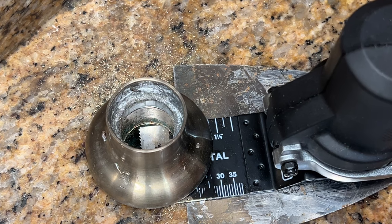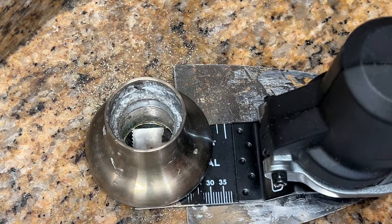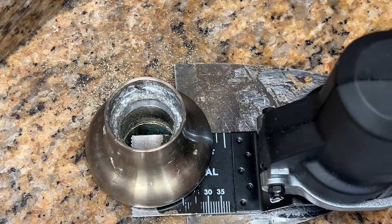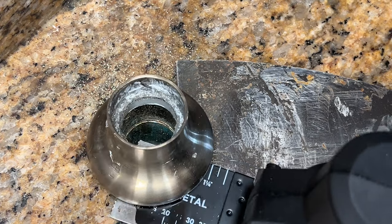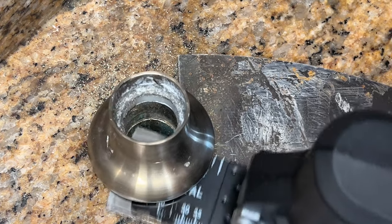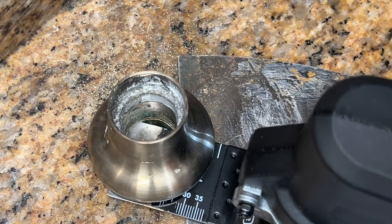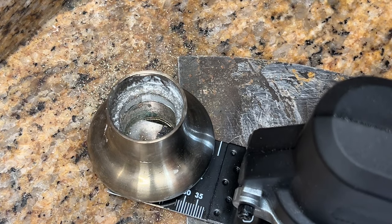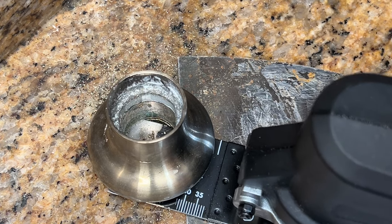When I knew I had cut through most of it, I got a little nervous about the forward pressure on the blade, so I kind of eased off a little bit and just let the blade do the work at the end, so that my oscillating tool didn't go forward too quickly and damage my granite on the wall.